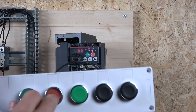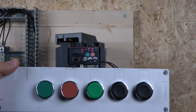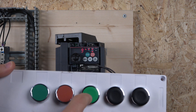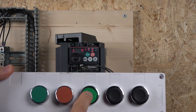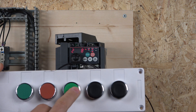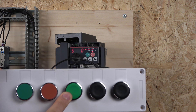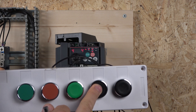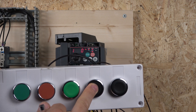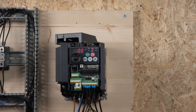If you don't want a potentiometer and prefer up/down buttons, just change parameter 59 to 1. Another feature: if you click stop and start back up again, it will return to the last memorized frequency. Holding the button goes all the way up, and holding the other brings it all the way back down. That's a pretty cool feature if you want to use buttons to control speed.